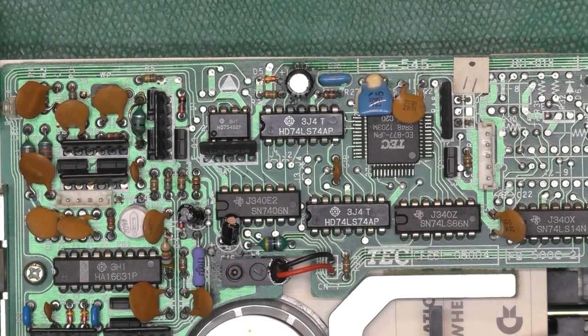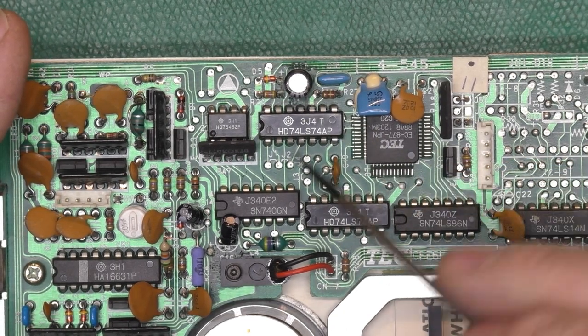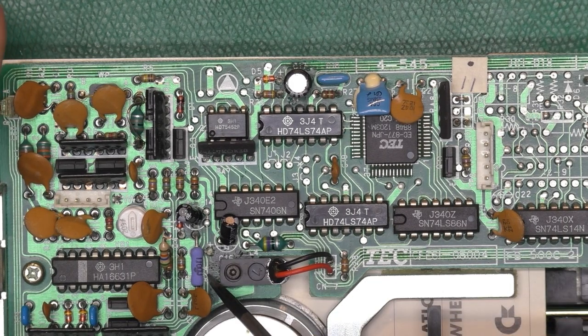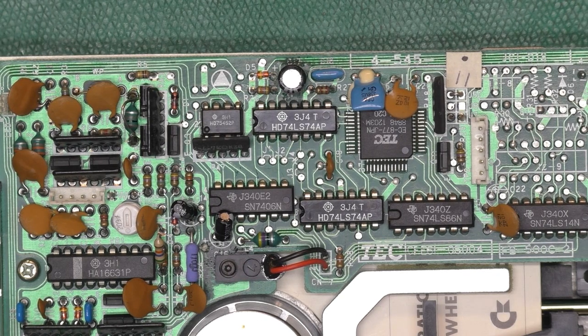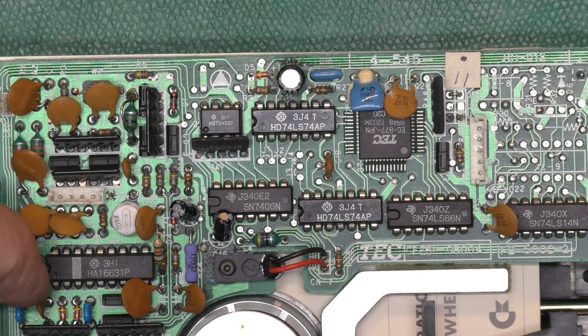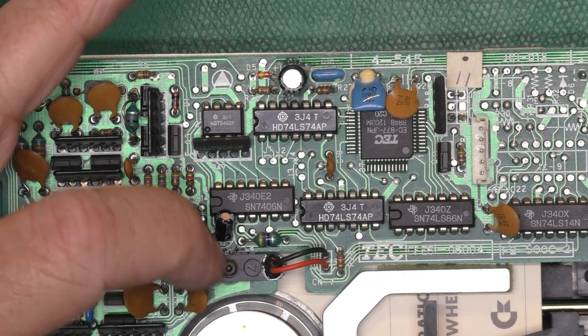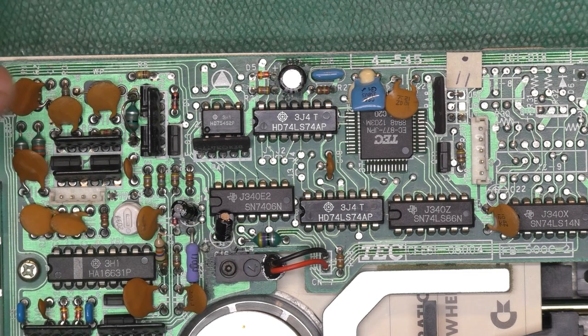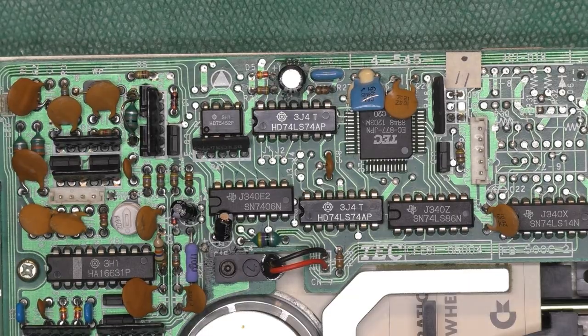I just started inspecting the disk drive, and these little capacitors here have been leaking. Got some damage here, quite a bit right through here. And these two over here don't look so bad. It looks like this unplugs, and there's 1, 2, 3 screws. And I don't know, this looks like a sensor here. That's probably just screwed into the circuit board, not to something on the bottom. Okay, so I think we'll have to unplug this and pull these caps and see how much damage there is.